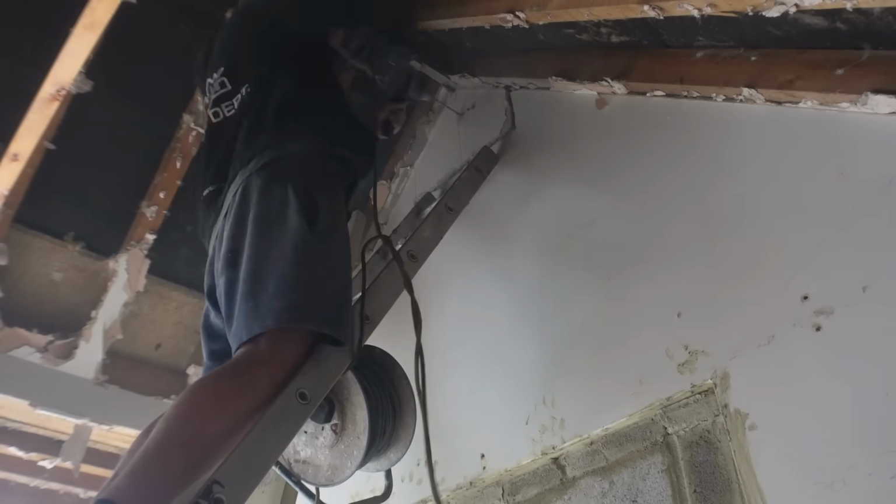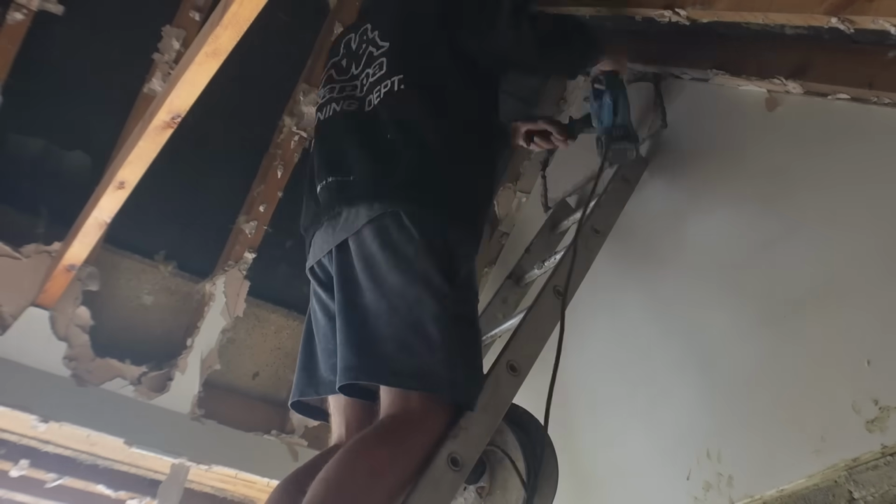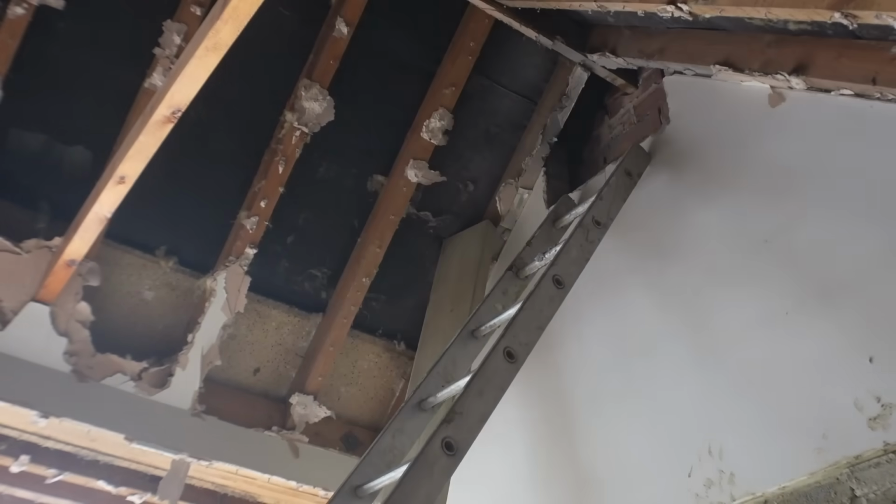After removing some of the blockwork at the top to create room for the padstone, the boys realised that the access is very limited up here with the roof still on, so they made the decision to wait until there is better access before tackling this.